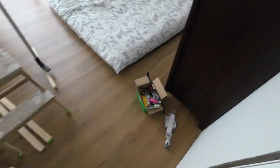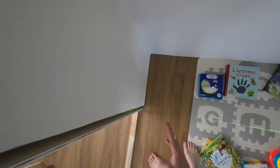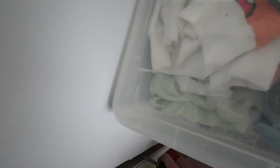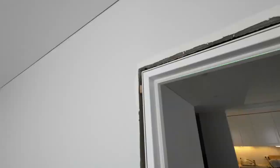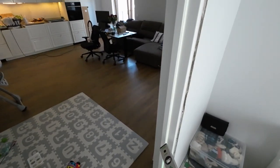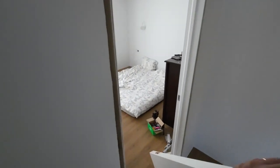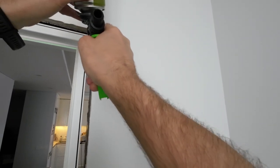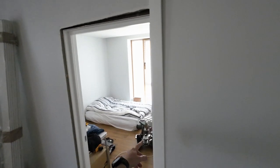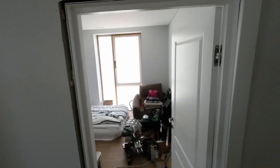I'm leaving a gap of one millimeter so the frame cover can be adjusted. Looks like it needs to be moved a little bit to the right side. This side is good. There's a small bend here but I think I'm going to make it straight. I'm not filling the gap yet because when I was placing these doors I thought it was quite perfect, but it turned out the door wasn't closing and I had bent the frame.